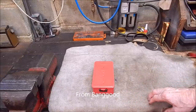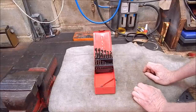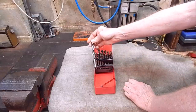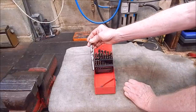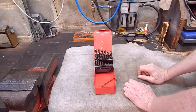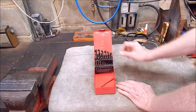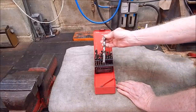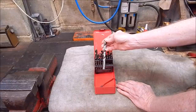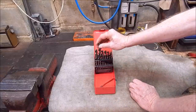These are just plain high speed steel drills and they've been really good. I gave them a full score - I thought they were excellent. I've used them a lot on the lathe because I don't want to screw up the shank. I only use these in collets. If you put drills into normal chucks you do horrible things to them, because in a collet the drills won't slip. But in a three jaw chuck those jaws are going to rip the bejesus out of the bottom if they do slip, and you can't do them up as tight in a three jaw chuck as in a collet.